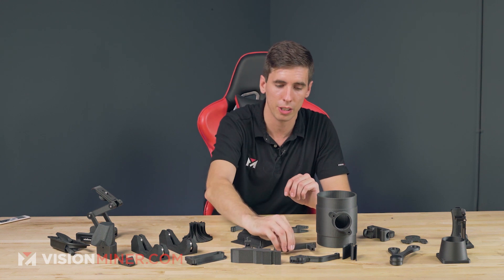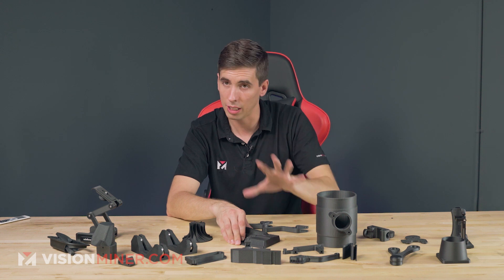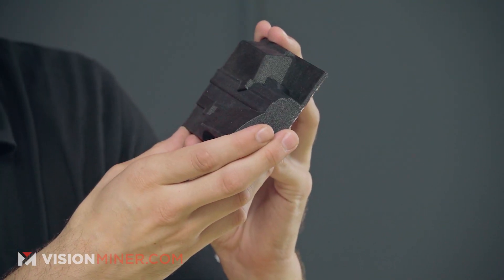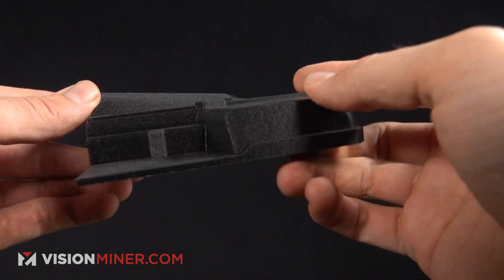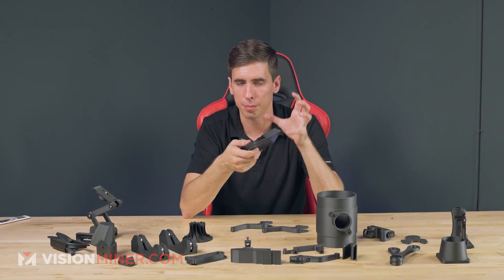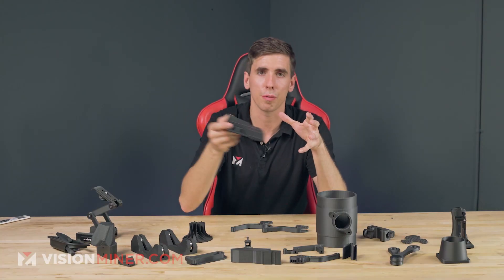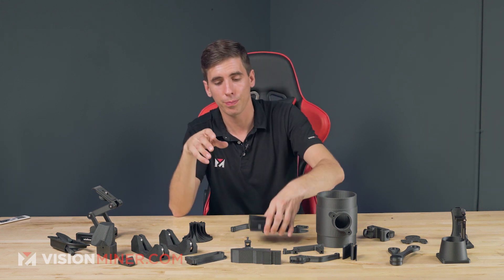Next we've got that bike part I was talking about earlier — it's a little bracket for the brakes, high temp CF-25, so it'll last and be able to resist the heat. This is a vacuum mold — actually a section of a vacuum mold — and we can print this in different ways to have air channels going through the entire surface, or print it totally solid and make it pretty well airtight. With the carbon fiber in the nylon, it can survive hundreds and hundreds of passes through the heat and temperature that you're exposing it to in the vacuum molding machine.